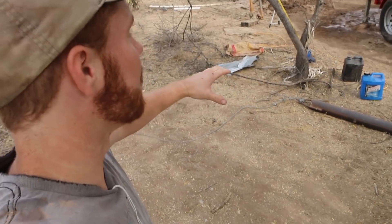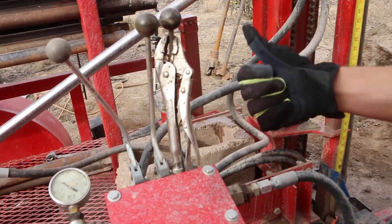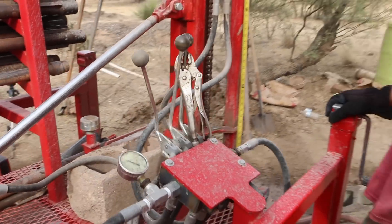We've been drilling for a little while here. I'm actually getting down a couple feet today, which is really cool. We ended up busting through that rock and now we're in just a real hard soil — it's definitely moving faster, which is awesome. I did a few upgrades to the drill; I have a pair of vice grips on the rotation controls and it works really good because I can get a really nice slow even speed, and then all I have to do is worry about pressure.